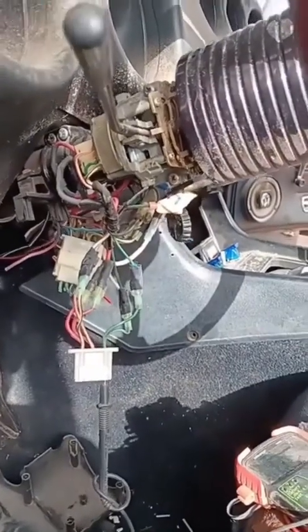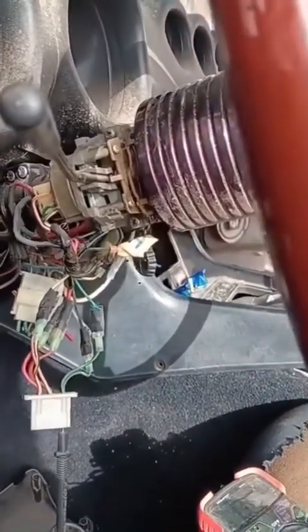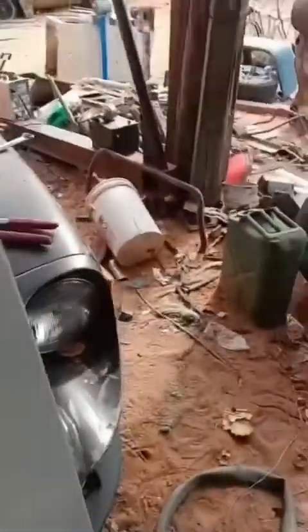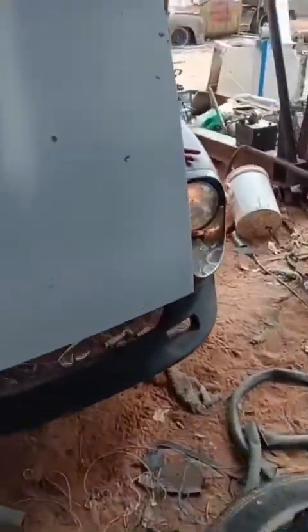Those are the leads for the lights, and it's because I had to run grounds and everything. But I was hoping to repurpose this one to not lose a bunch of the lugs and all that. I just bridged it through and used this universal flasher resistor. But I should have blinker. Just running some tests, and then that blue one should be blinker for the other side. I put them all to the flasher just to see that I have all of them working. But yeah, should be golden.